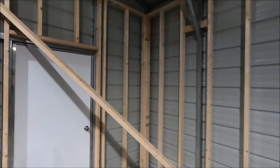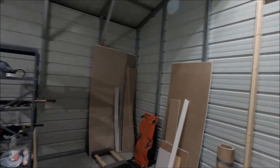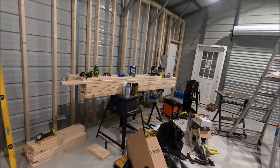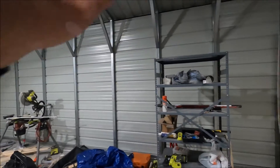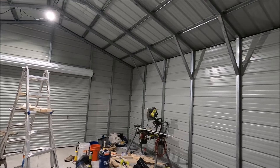I'm going to start framing again. I framed this wall but didn't film it because I had to get the wood out of the way to get some other stuff done. I'm going to finish framing up these walls and I have a couple of small interior walls to put up on this side. Then there's going to be beams that run across both sides, and I'm going to put the ceiling in — just two-by-eights spanned across. Stay tuned for those videos. I'm excited to get this thing framed in and insulated because this metal building with a cement floor is super cold. I definitely want to get the wood stove in as well. Thank you for watching, and have a Merry Christmas!